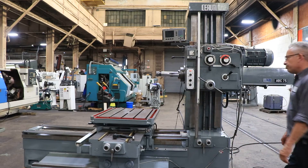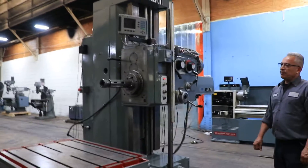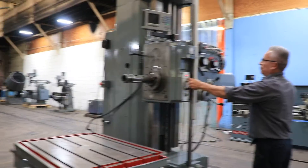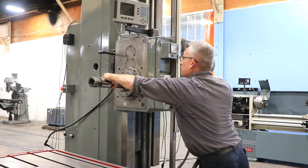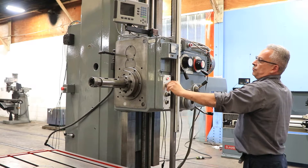Running right now at a low speed. The machine has from 15 up to 1500 RPM. That's hardways on all axes. Three-axis digital readout. The spindle taper is a number five Morse taper, and you can also see it has a quick switch adapter inside of that.